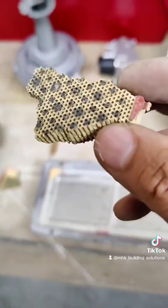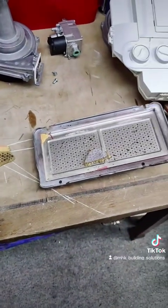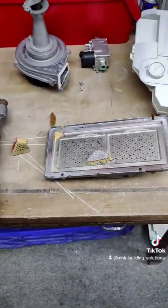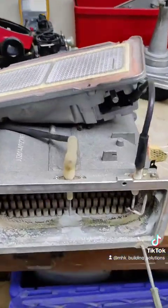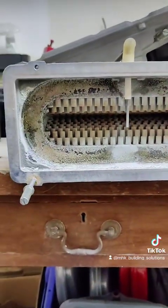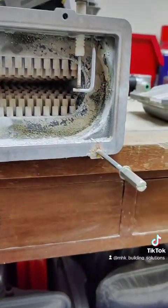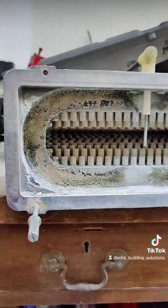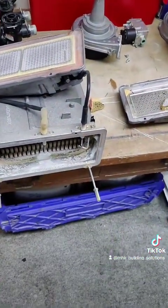So that's what causes the inefficiency in the boiler — the boiler not giving enough heat out, not warming your water enough, and also making humming noises at times. This is inside the heat exchanger. Obviously we've got a flame rectification device and the ignition probes or electrodes. That's what a stripped-down burner and heat exchanger looks like on this Ideal Logic.